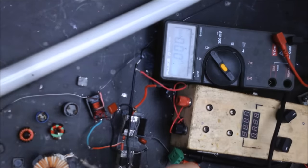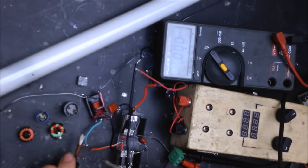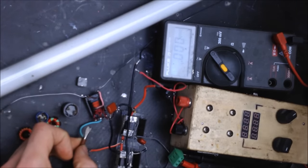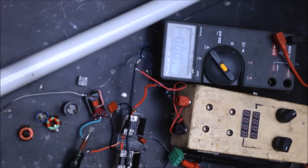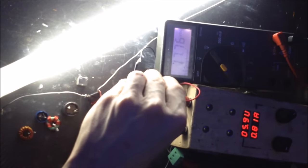Now, because it's a steel material, of course, it's going to be rather slow, so I expect this to be a really ineffective inductor. But we're going to see exactly what changes on the meter, because I'm curious to see how well of an inductor a screwdriver and some network cable will actually be. So, I'm going to pop that off. So, not a very good inductor, of course. But it's kind of working. As you can see, once it's stabilized, it was drawing a lot less current, and it in fact did work. So, very easy way to make an inductor.